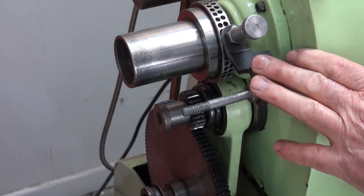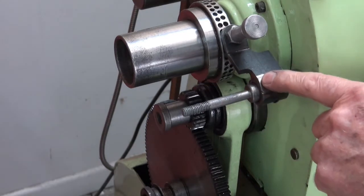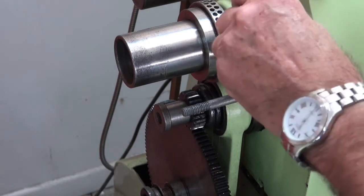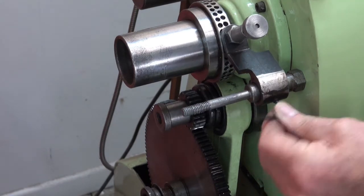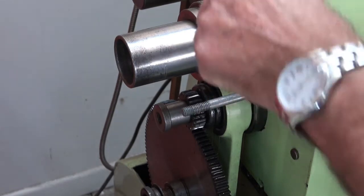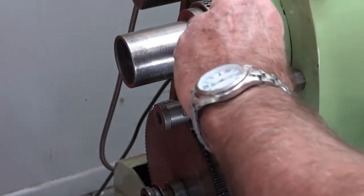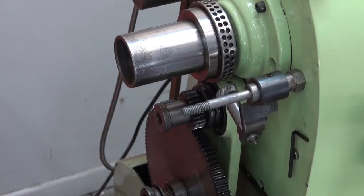It's really important that you lock out your electric motor on your lathe when you're doing this - I always wonder what would happen if you turned it on, it would probably just bend or break something. I keep the Allen key on a little magnet on the end of the headstock so I can find it quickly. For most work this allows me to do cross-drilling or drilling in the lathe without having to take the work out of the chuck, giving you accuracy in the setup.